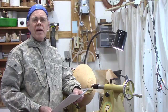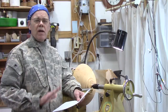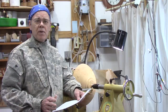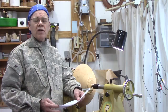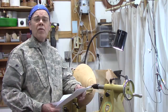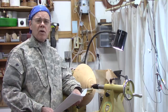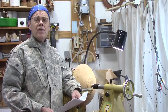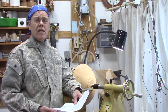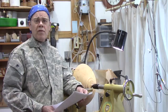You also need to slow down when sanding. If you sand too fast, you'll heat up the surface of the work, your sandpaper will tend to skip over the low points, and the heat damages the sandpaper. By overheating the surface you can cause checks — especially on exotic woods and end grain — those tiny minute cracks from overheating. Be aware when shopping for a lathe that some mini lathes and larger lathes may have a slowest speed as fast as 850 RPM, which is too fast for rough-turning a bowl. If your lathe's slowest speed is about 850, you'll need to ensure you have a well-balanced blank through band sawing or chain sawing before mounting it.